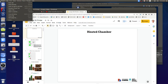I mean, we could actually start turning on those heat bands and maybe get out the 1-inch pipe and augers, so maybe start working on that. On the printer, as soon as we get the belts, tighten up the belts and run it. See what we get, and in terms of the bed heating, how even that is, if we have to correct it. One thing, we would want to turn the bed 90 degrees because the wire goes all the way across. It could be close to the controller. And that wire, we've got to switch it out.